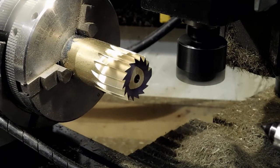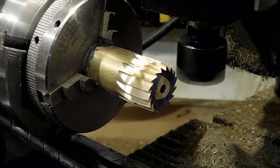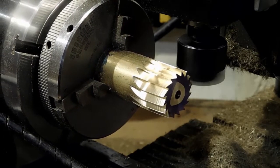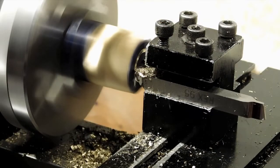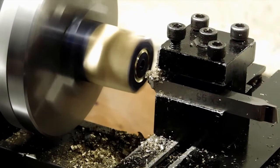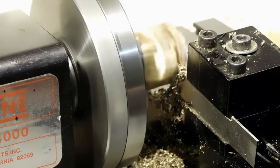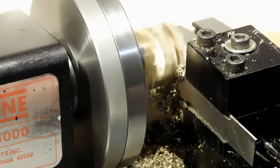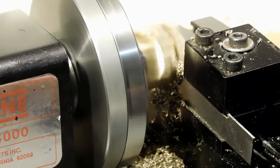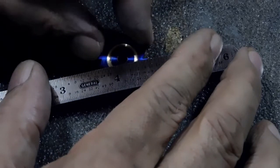This ought to be the last cut. Now I've got a rounded cutter here and I'm just making a plunge cut into the face of the ratchet — just something decorative. Now we'll cut off the first wheel here. And now I'm just squaring out the center hole so that I can square it to fit the mainspring arbor.